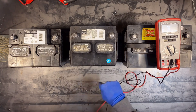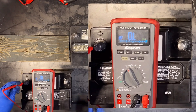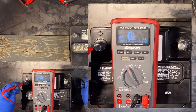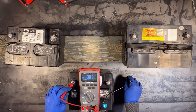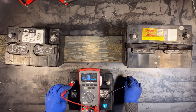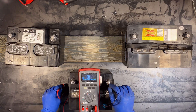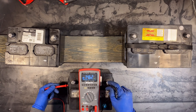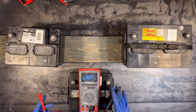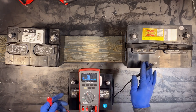Let's try something else. We're going to take these batteries and put them on the steel bench. If there's any continuity from this battery to the table we'll be able to read it. I'll do two measurements — let's try continuity first, from the positive to the table. Nothing. Negative to the table. Also nothing. We go over 40 megaohms again. Try this on the negative — over 40. So we get the same result as when we put the terminal onto the case of the battery. It's interesting that this older battery — a year older than this one — has a little bit of continuity between the case and the terminal.